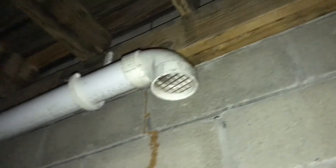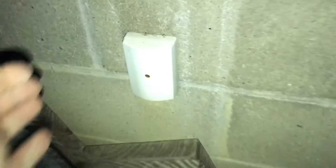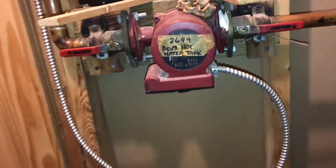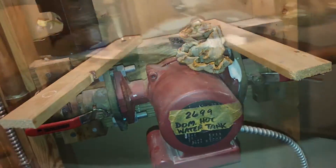It'll freeze and block it and the boiler won't work — this screen will be filled with ice. The furnace also needs to know how cold it is outside, so this sensor gives that information. The boiler also makes hot water for the house — this is the hot water that goes into the showers and the sinks — and here's the pump from the boiler into the hot water tank.